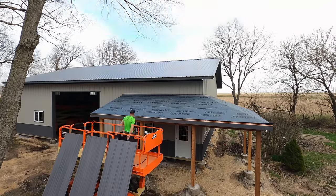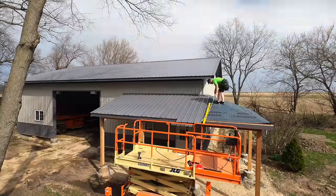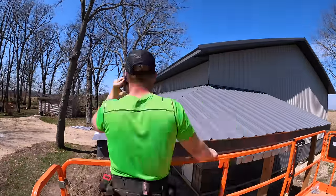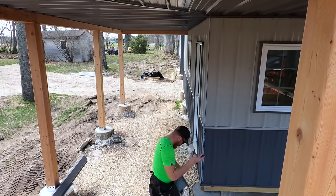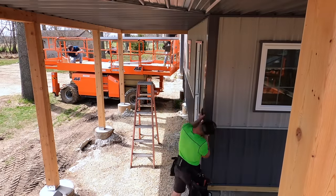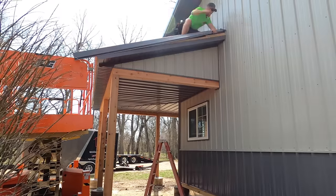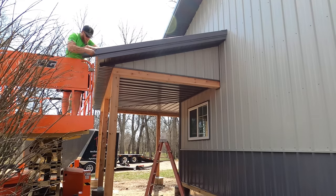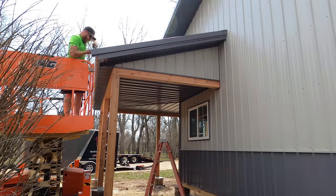One thing you'll notice as I'm installing our roof panels on the porch is that there's some wood showing — that's because I forgot the trim piece that goes there, a gutter drip or eave flash. I'll come back and install that at a later date. We've got corner trims to install — I like to try to make them look seamless, one piece. I also did a video on that, check it out in the tips and tricks section of my channel. We've also got a piece of outside corner gable trim that I'm cutting specifically so our gutter will cap into it and look nice and clean.